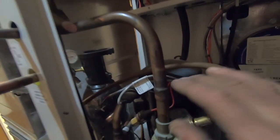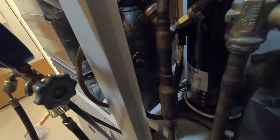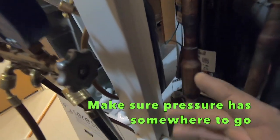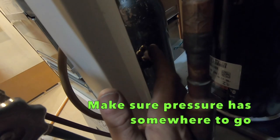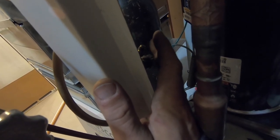It's hooked up to my discharge - remember it's all connected upstairs now, so the coil is part of the loop. Make sure the other side - the liquid side Schrader - is off, because that last joint you will never do with pressure built up inside; you'll just be blowing out. Always make sure that Schrader valve is out on that last joint. It should be out anyways - it's out right now and I'm pumping nitrogen right now; we'll braze it up.